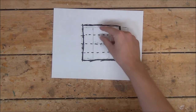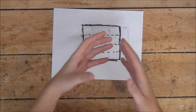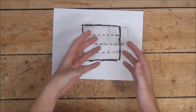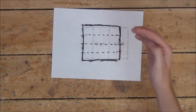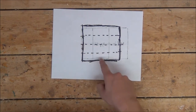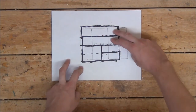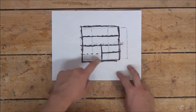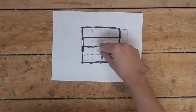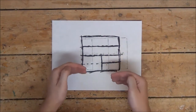Every shelf gives us about eight inches of space to store the shoes, which should fit most shoes. But what if you want to store boots? They're not going to fit in these shelves unless you put them in there sideways, and that's going to look kind of sloppy. After thinking about it, I've decided I'm not going to cut a channel in the bottom left side, but instead in the bottom center. That way we can build something like this: two full shelves on the top, two half shelves on the bottom, and then a large open space where we can put boots.